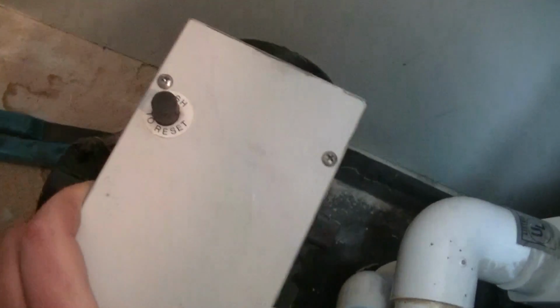And the pump worked perfectly, but the heater wasn't working. So digging into that, here's the heater unit and what it does. Let me explain how it all works here quickly and simply, hopefully. The tub's a little dirty right now. It had some rust in the pipes. But you fill the tub up with water higher than this. This is the inlet for the pump.